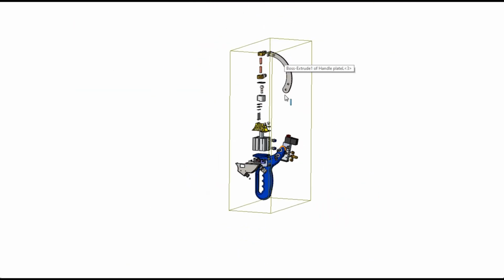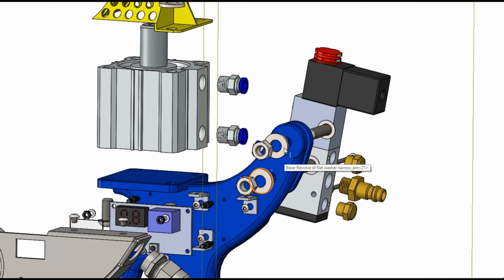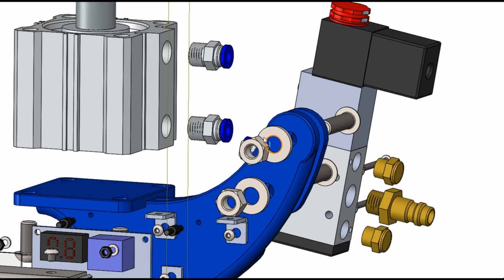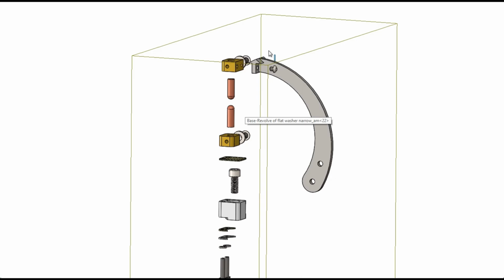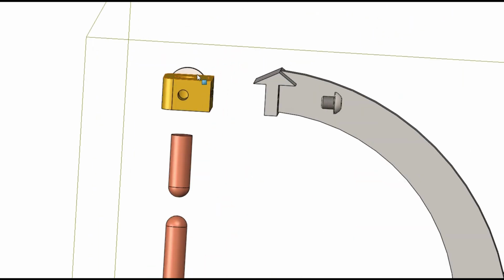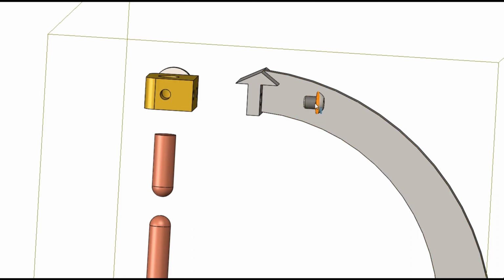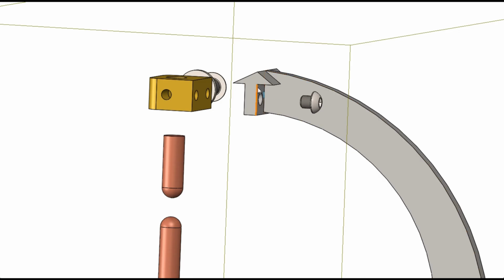If you ever need to replace the arms, I use nuts and bolts instead. These nuts are actually on the item itself. They are cap dome nuts, so they're much fancier looking with no sharp edges and stuff. So we'll work our way down from the top here. Okay, so these are M6 by 10mm bolts. They hold this brass block onto this arm.